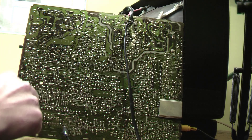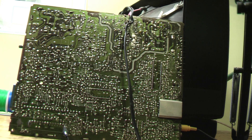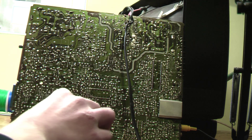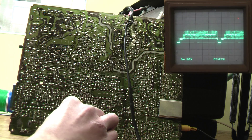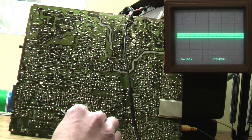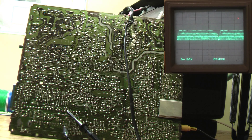This is the IF and sync module. I'm supplying the TV with a composite video signal, switched to the composite input. I'm going to test pin 13 first, which is where the signal enters - and that looks all right. So now I'll check pin 16, which is where it leaves after that switch. And that doesn't look very good, so I'm guessing that switch is faulty.